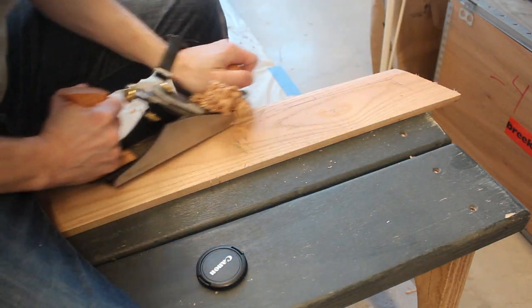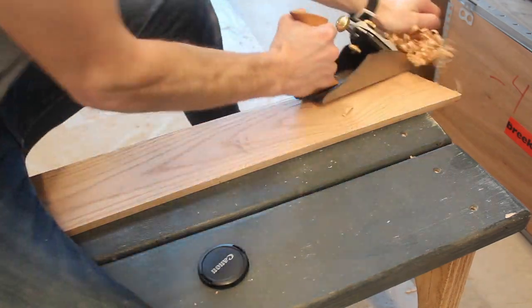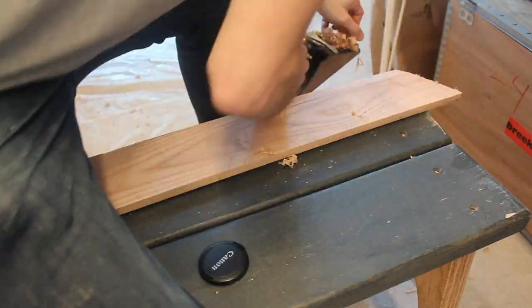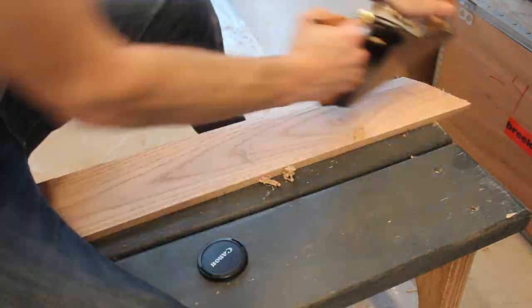Just as with the other strakes, the shear strake needed to be slightly shaped so that it would taper in at the bow and the stern, and also the angle would fit perfectly with the previous strake.